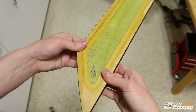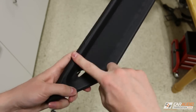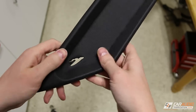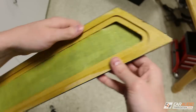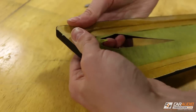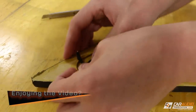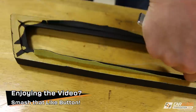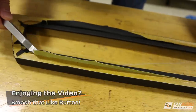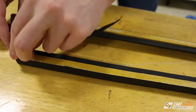Because I allowed some extra material this is going to be a little easier, which I definitely need since the inside of the shape and the corners are pretty tight. I can cut a small relief cut if needed, but I want to push as much of the vinyl up that angled edge as possible so it's flush with the back side of the piece. I can cut more reliefs to go into a corner, then fold the material around the back side and secure it by pressing it against that rabbeted edge. After going around the inside of the shape, I can use the rabbeted edge to guide my knife and cut the vinyl straight.